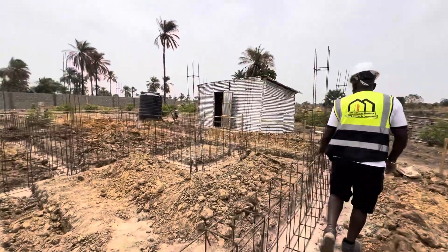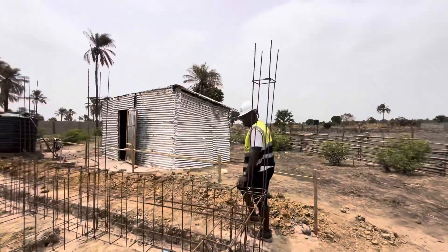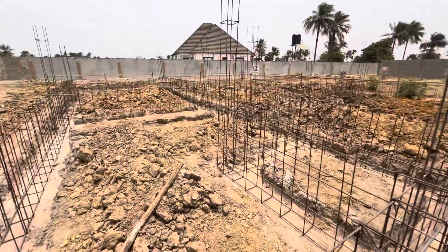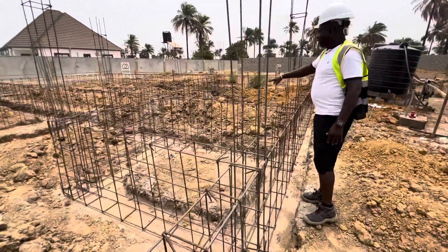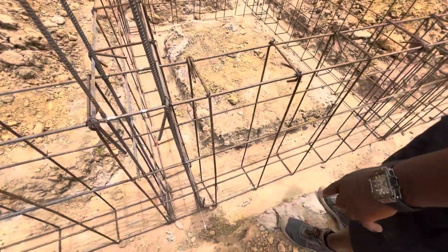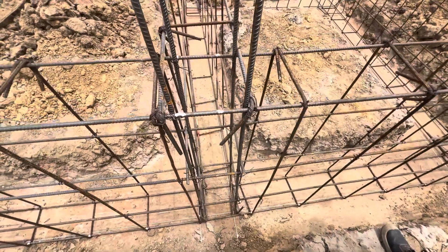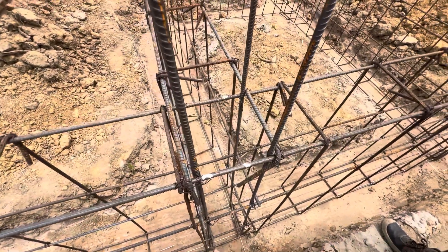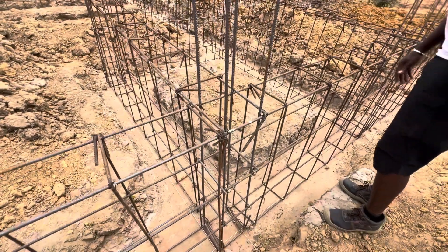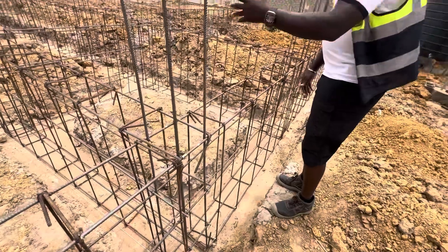Let me show you something that we did. So this area is going to be our staircase, and this area is going to be a sit-out for the kitchen. You can see the blinding that was done. And those white lines — those white lines are the lines of the thickness that we follow. That means we had to do the setting out separately for the iron rods, for the beams coming in. We marked out the lines, and those lines are for the beams.